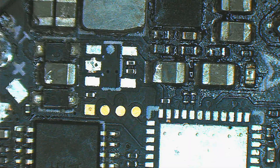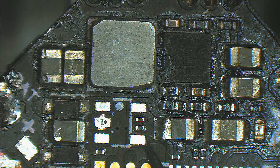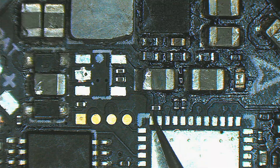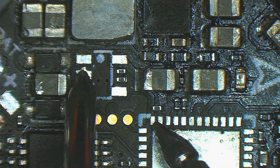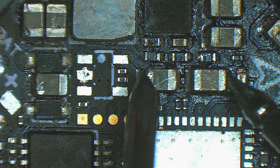Now let's power on the FC again — no more buzzing sound and the current consumption is pretty stable. The output from the voltage regulator goes through here and after that goes through this trace to this pin, which is our 3.3-volt regulator. This is ground for sure, so let's probe here — and we have a dead short on 3.3 volts, meaning something is fishy here.